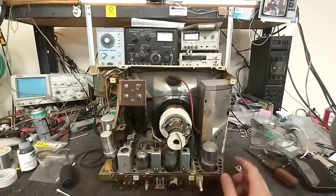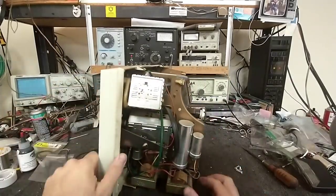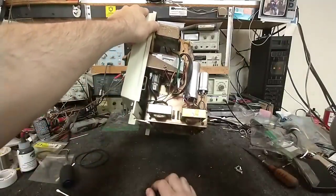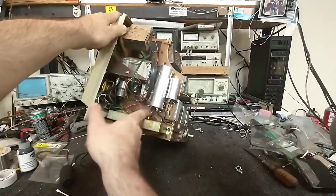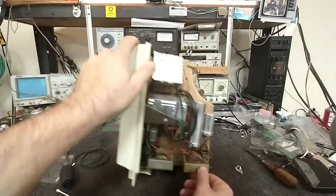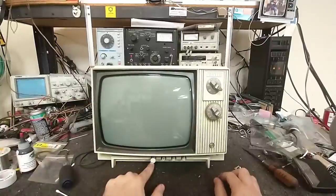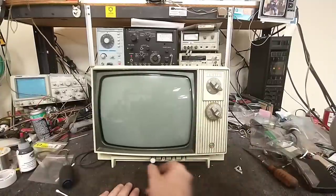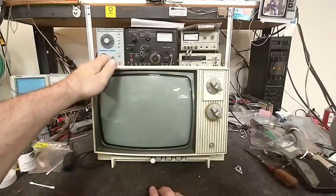Lots of compactrons. This is an RCA tube that's been replaced - the rest of them appear to be Zeniths. And there's your tuner with your RF amp and mixer oscillator. This wiring has been replaced, because there's no way a soldering job like that with this loose wire would have gotten past QC at the Chicago plant. So I guess this is the on and off - it has to be. Because this is brightness, contrast, vertical, and there's obviously nothing there. Never seen that kind of setup before - but it's the first time I've ever encountered one in person.